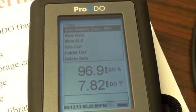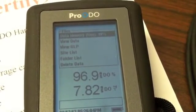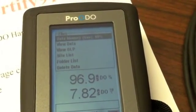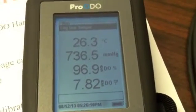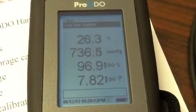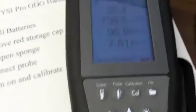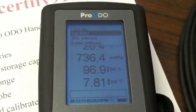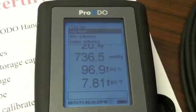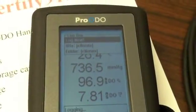That's especially important if you want to look at the data you've entered. When you're at the read screen, it's live, and at the top it always says Log 1 Sample. Anytime you're at that screen and want to log, hit Enter. Right now we don't have any site or folder information, but we'll just hit Enter — and that saves all this data.